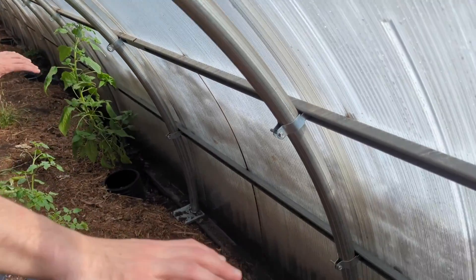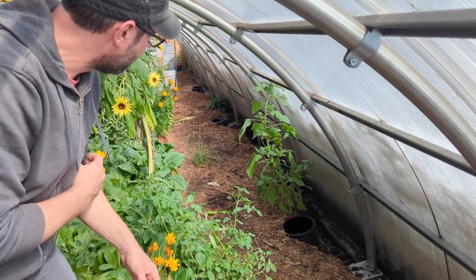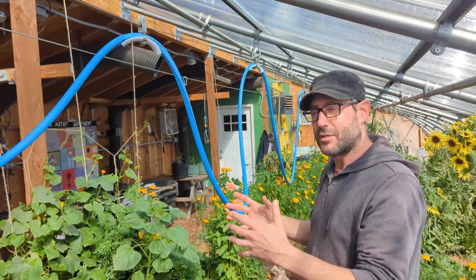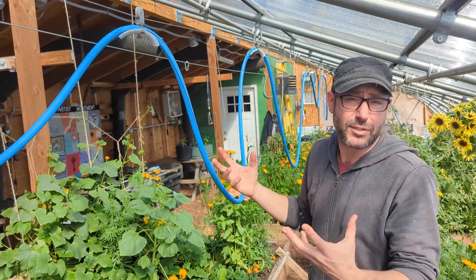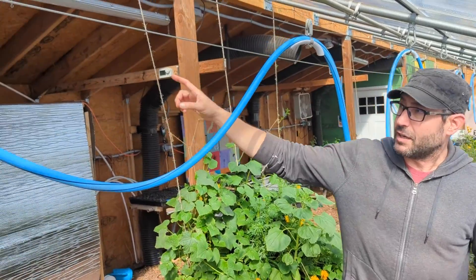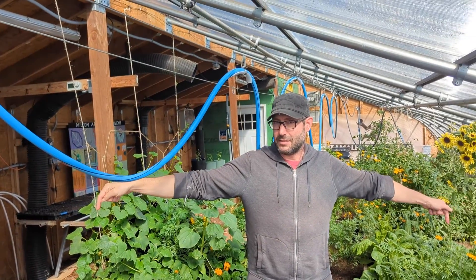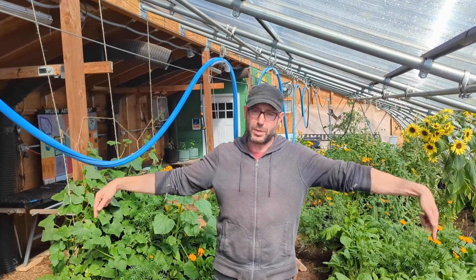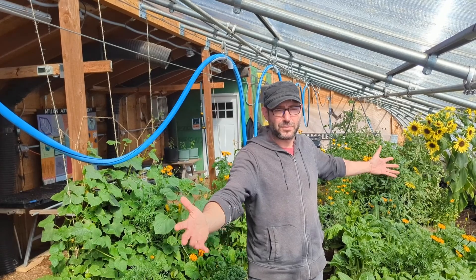Then it meets up with another manifold at the base of the glazing wall, and there's an exit for each of these duct systems at the base of the glazing wall. There are five of these duct systems in this greenhouse so we've got a good amount of airflow, really trying to make as much use of the excess solar heat as we can and charging up the ground underneath us. The intake and the exhaust in these transit duct systems are at opposite ends — that's very important so that we're equalizing the pressure distribution and airflow through the transit ducts. Otherwise it's going to take the path of least resistance and go right through the middle one, leaving the ones out to the edges pretty much stagnant.